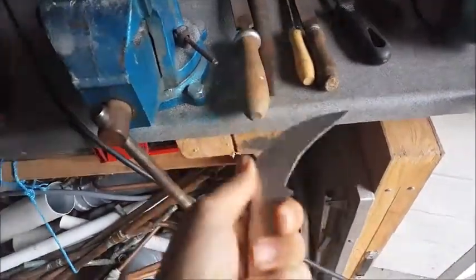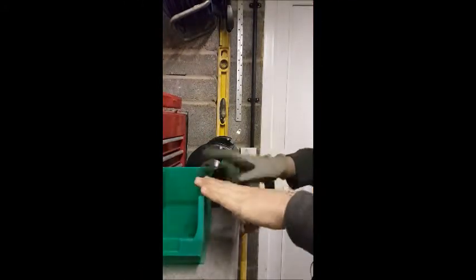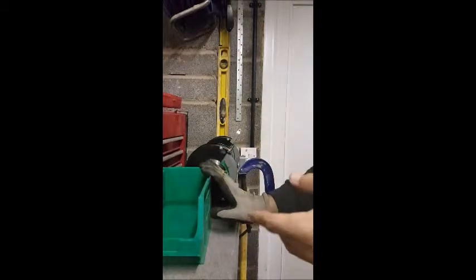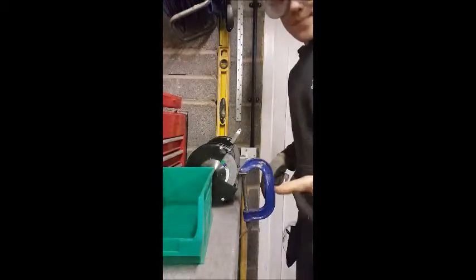Now we've got to move on to the grinding and think about the handling before we start grinding. I've got my grinder ready, set to the correct angle. I've traded in my glass for a plastic container with water instead, because it was pointed out that glass isn't great to store next to a grinder. I've also got tight-fitting gloves that hopefully won't snag in the chuck. Got my goggles on, ear defenders going on, and I'm moving some flammable stuff away because grinders create sparks.